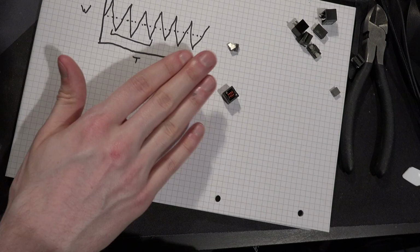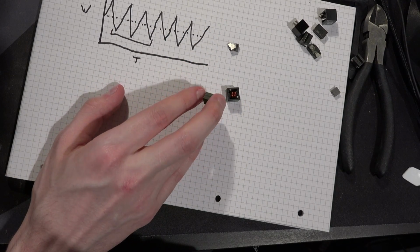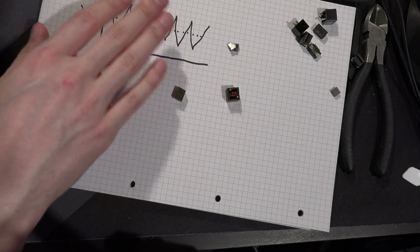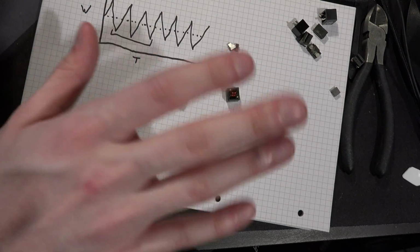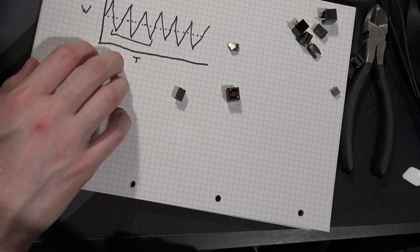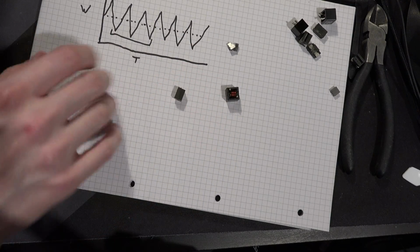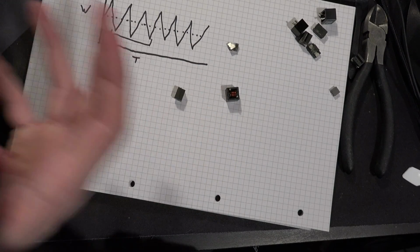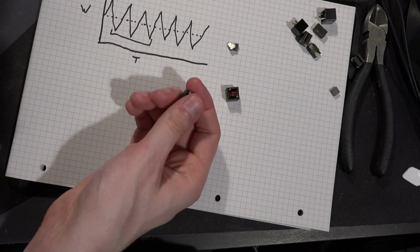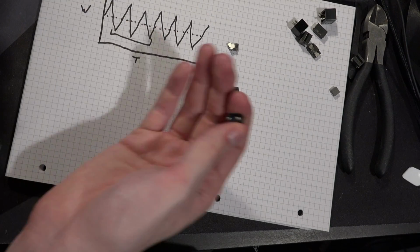Also, thermal pads pushing down on the inductors can actually achieve that same effect, which is potentially why, if you go from a stock cooler, which has thermal pads on all of the inductors and all of the MOSFETs and just everywhere, to something like water cooling, where the inductors don't have anything pressing down on them, then it's possible that the inductors will be undampened, because the only thing keeping them in place is the construction of the inductor itself, and that's obviously worked loose if it's producing coil whine, right?